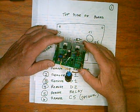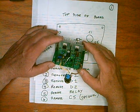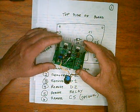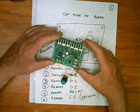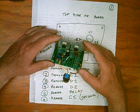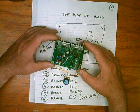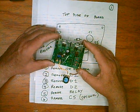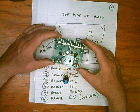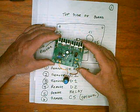These FETs — even though they say in the listing that they're 75 and 75 FETs — that means they're 75 volt, 75 amp FETs. This is called a 300 watt inverter board, and they've actually gone to a 55 volt FET now on many of them. That's much better if you're using it as an inverter. But if you're going to be doing water heating, I suggest water heating from anywhere from 50 volts up to about 80 volts with this board. Beyond that, you should really look at a different design.